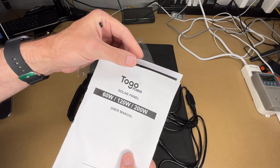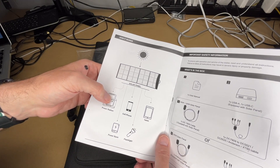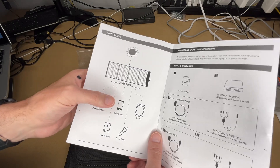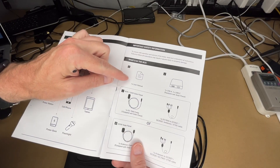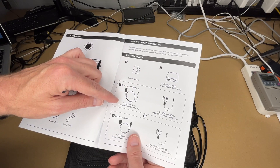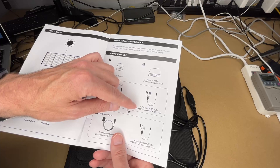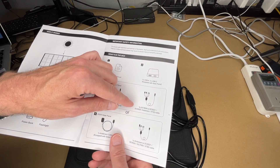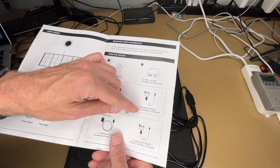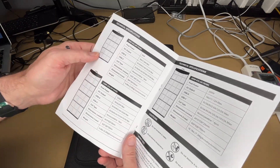Let's check out the owner's manual. It shows how it works: we have the sun and the solar panel, and you can plug this into a portable power station, a power bank, a cell phone, a flashlight, or a tablet. It has a USB-A and a USB-C port. It has a DC 7909 cable attached to the solar panel, and then a DC 7909 to DC 5521, DC 5525, Anderson, and XT60 multi-headed cable — that's on the 120 watt model.